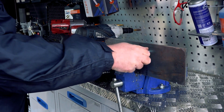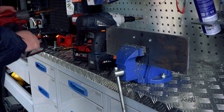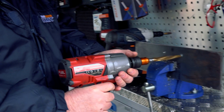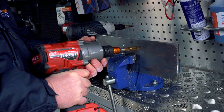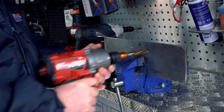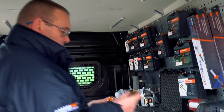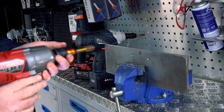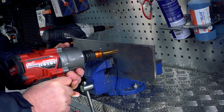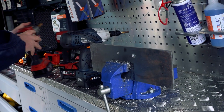And then if you want to widen that hole, or if you get holes that don't line up, you can use a reamer. This is a 14mm reamer — and straight through. So that's now a 14mm hole. And then we'll put a 16mm tap through that. All interchangeable, really quickly. There we go.